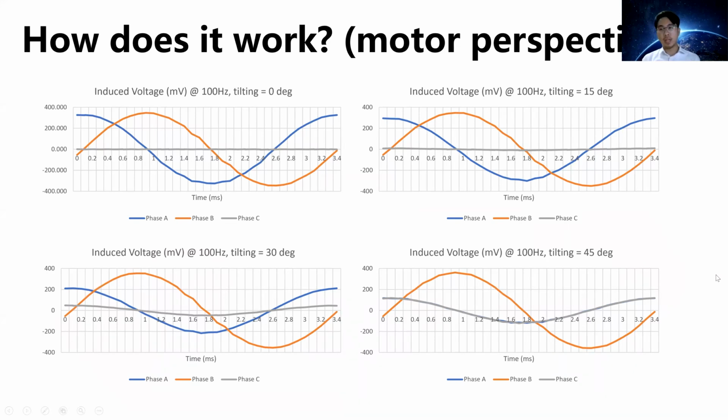So let's look at the scenario in the upper left-hand side of the diagram. You can see when the copper coils are arranged in a hexahedron style, then we connect the opposite sides of the coils as one phase. So there are phase A, phase B, and phase C. They are arranged just like a box to be able to collect most of the flux that is exerted by the rotor.